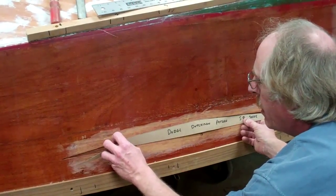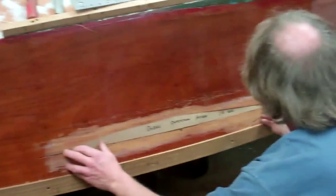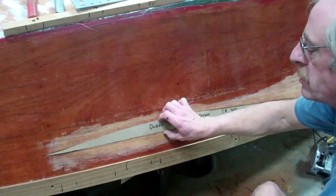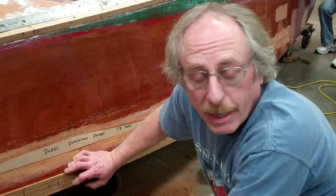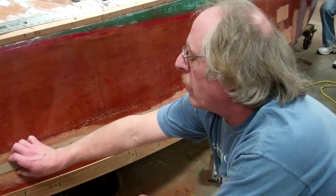No, I didn't use a crayon on the edge. I usually just cut them in with the scissors, get them really close. The Dutchman's always going to have to be sanded anyway, so if my pattern's a little bit big, I get the pattern as close as I can and then I cut my Dutchman just a little bit bigger all the way around.